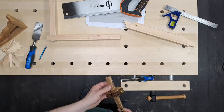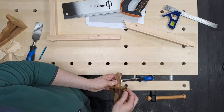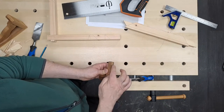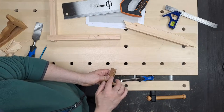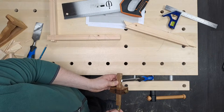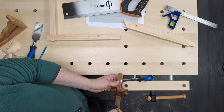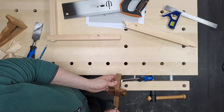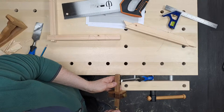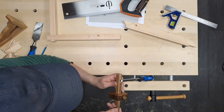And at that, we will loosen up the block, get my head out of the way, loosen up that block, and we're going to turn this, this pin's fixed. We're going to make this pin the size of that chisel, the width of it. And when you're doing this, it doesn't go to the width of the full chisel. I'm not explaining this too well, am I? The top of those pins, not the base of the pins, must be the width of that chisel.